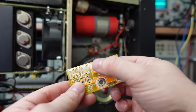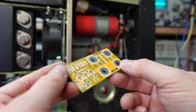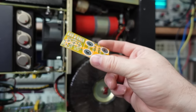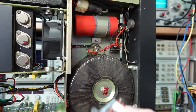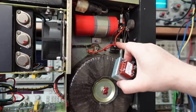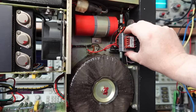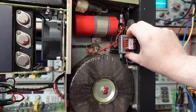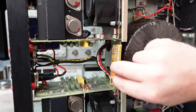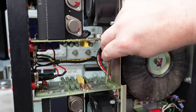Annoyingly, this is designed to connect directly to the speaker output terminals, which don't fit on this thing at all. I'm going to have to work out how to mount it as there doesn't seem to be much room. My thoughts are maybe to mount the transformer there - though it's a bit close to the bridge rectifier. I can mount this on the front if there's room, and the board can go there - that'll fit quite nicely. I'm going to have to put some standoffs in because it's going to short out on the chassis.